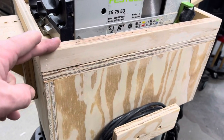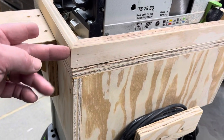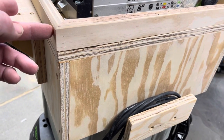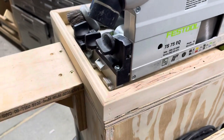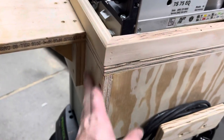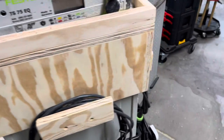Knowing what I know now, if I was going to build it this way from scratch, I'd build the box including making this one piece — make this part of the box — and the bottom, or top of the box depending on how you want to look at it, would just be inset like that. So you'd have one solid piece of plywood instead of the edges. I certainly don't mind this, but if I were going to make something that mattered more — like furniture — I wouldn't want to have the plywood edges showing.